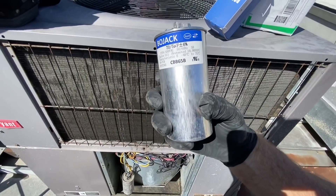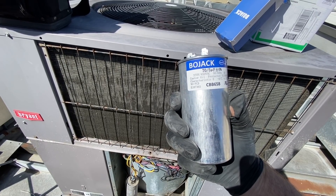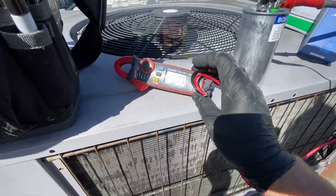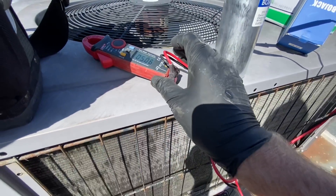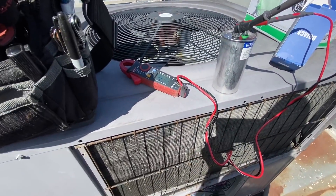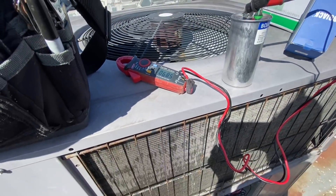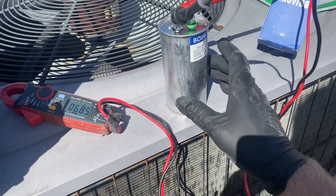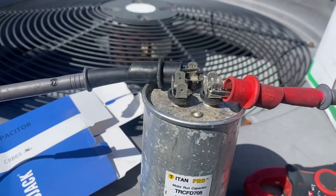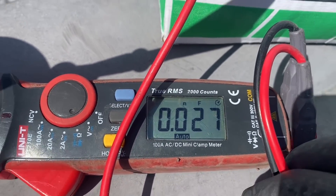Let's see how BoJack makes out. We can be within 6% of spec. Let's check the fan first. All right, BoJack, let's check our Herm. Give the old meter a minute. 68.5. 68.5 is within spec, we're not less than 6%. So let's let her rip. Titan can go 5%. Common to fan - that's a no-go.